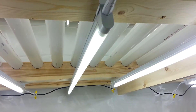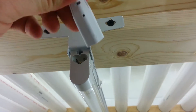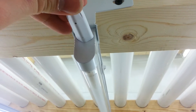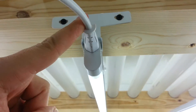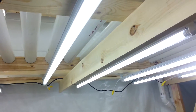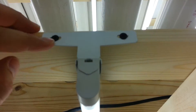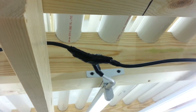If you're familiar at all with these T5 lights, you know that they have these little pigtails. This is the power adapter for each of them. And what most of these do is you can daisy chain them. So this would normally come from the power outlet, they can go down to the end of the T5, and then in this little port here, you've got a jumper that can jump from this over to your next light.